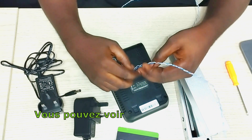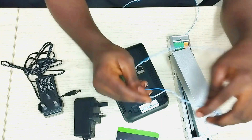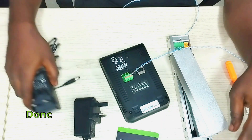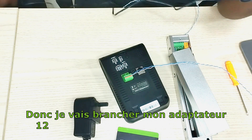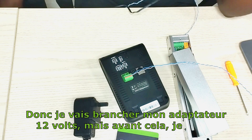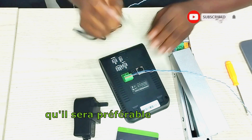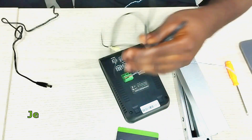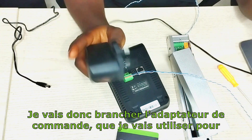I'm using two strands of Ethernet cable — we have the blue and we have the white. I'm going to be plugging my 12V adapter. But before that, I think it would be better to make the connection first, so I'll plug the other 12V adapter which I'm going to be using to energize the lock.